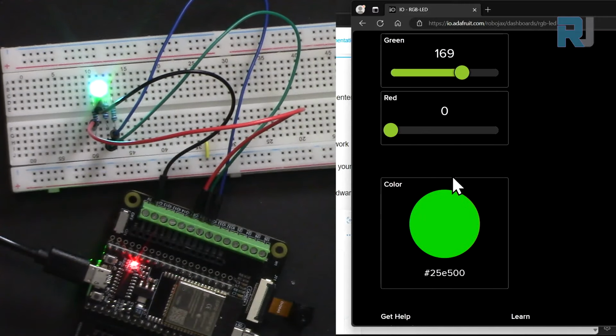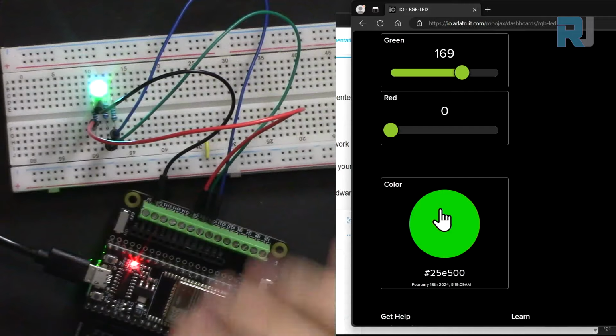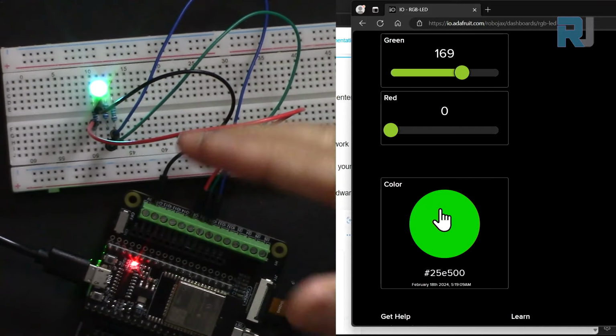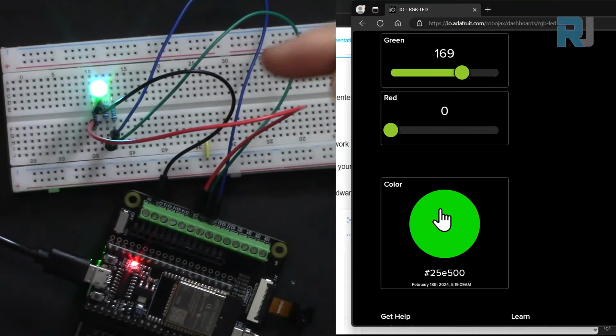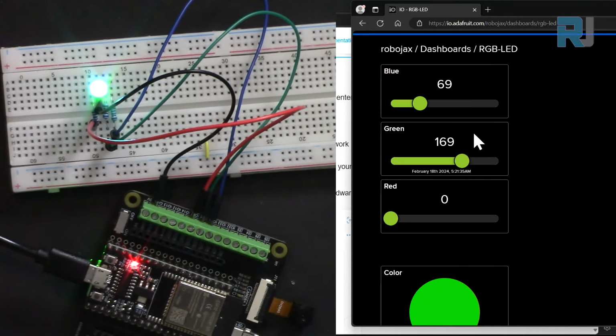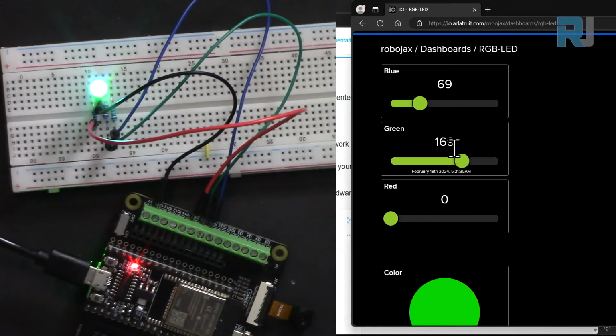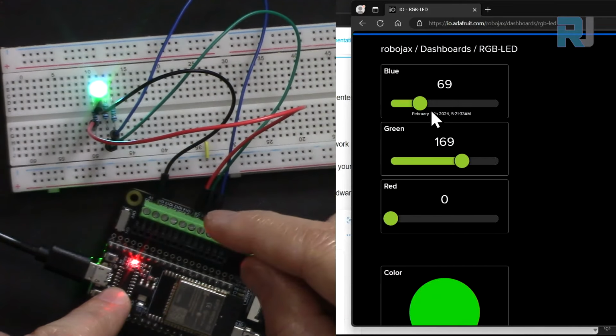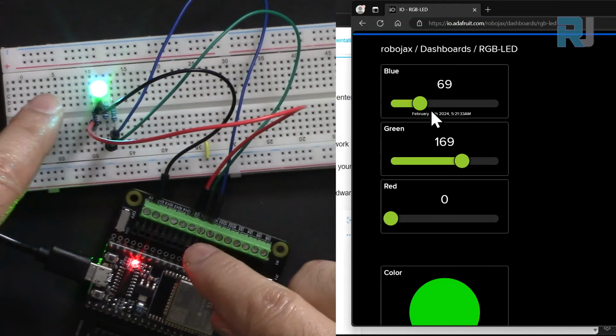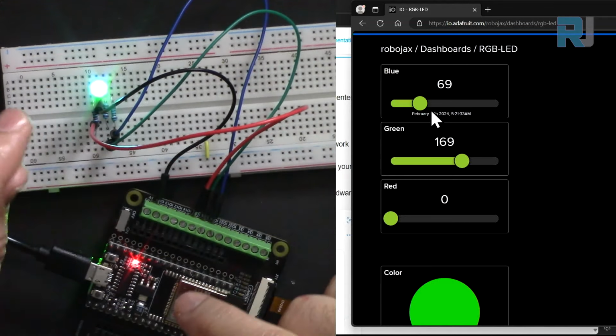And also we are going to use the color picker, and with the MQTT protocol, we are going to subscribe to a topic on the MQTT, and this will read the subscription. This portion is called the publisher. We are publishing the values to the MQTT broker, and this is a subscriber to that topic where we can get it. So this pulls the subscription value, and whatever the value is, it sets the RGB LED color.